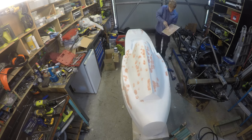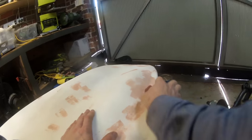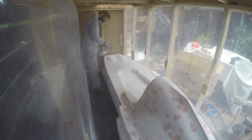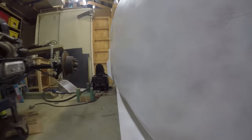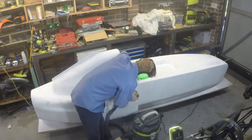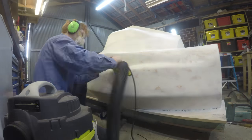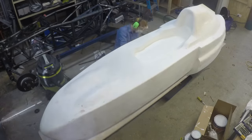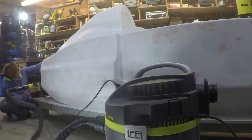The process was much the same as when I was bogging and sanding the plug, only I was now looking for smaller issues like little potholes or scratches that would show up in the bodywork if I didn't take care of them now. I also looked for areas where the light showed a depression or hump in the surface, which wasn't really visible before I made the plug shiny by painting it. My father attached the sander to the vacuum which was really great — no dust was released into the workshop while sanding. This was something I really should have done a long time before.